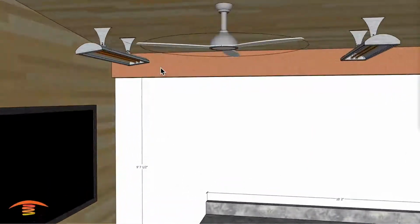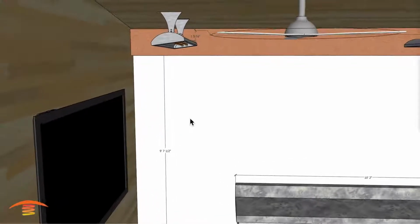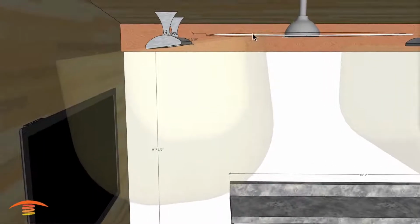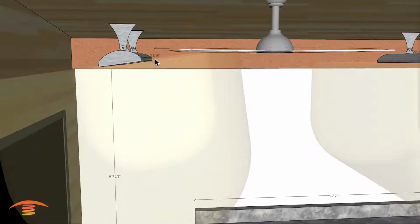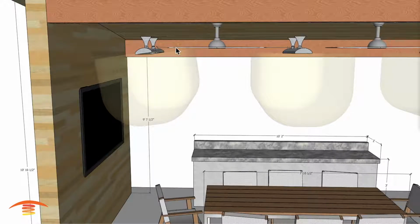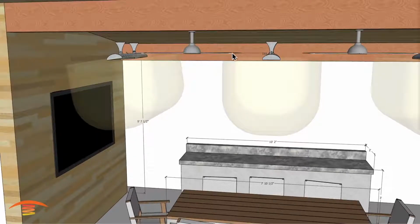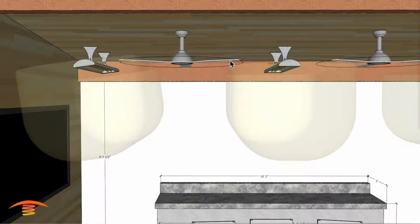So whatever this fan height is here, I've lowered it so that this edge here is below this edge here. And then I even went further with, I've changed this to a 6-degree tilt so that we're not hitting the TV set here, which I believe is going to be there. So I've changed this to a 6-degree tilt, and if you notice here with the clearances below, I've moved the heater down a little bit further, and I moved all of them so they look uniform. But I moved them all down approximately 2 inches, 2.5 inches. You may just want to drop it down to 3 and be okay. But in any case, that's what I did in order to achieve the clearance above, if this fan, again, is a wooden fan blade itself. So if it's steel, you could just go right to the edge of the heater itself, the same height, I should say, as the heater elevation here, the fan blade elevation here.